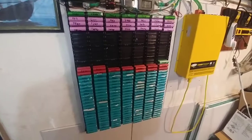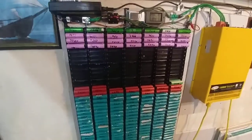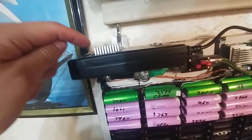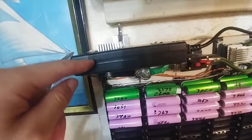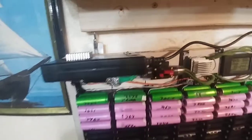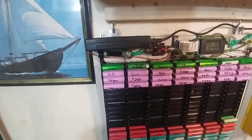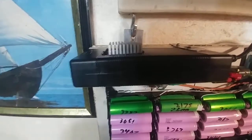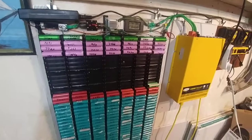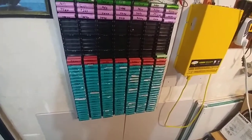It's doing good. Right now as it stands, it's somewhere around two kilowatt hours of power that this thing's got going for it, which is awesome. But there on the heat sink there's 66 volts AC, so I'm going to have to figure that out — maybe take the whole thing apart — because I did a lot of testing and there was never any voltage on it, and now suddenly there's voltage on it. Something's gone wrong, huge problem.